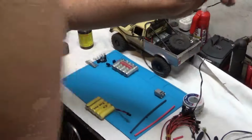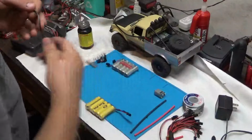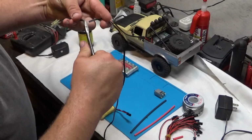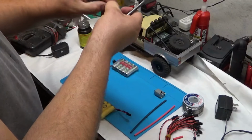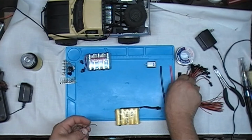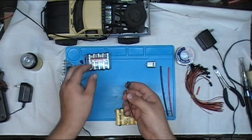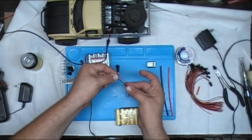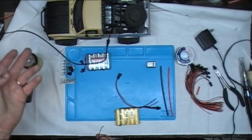So, since we already know which side of this is positive, which is the white wire, you're going to clip it off. I always like to leave a little extra room with plugs like this because I can reuse it for something else later. And then you just pull them apart. And you always want to make sure the plug that you're using, the color of the wire matches up on the other side, and this one does not. Clearly, the red turns into black. So these were wired backwards in China, so not a huge deal. I'll just hook them up backwards.